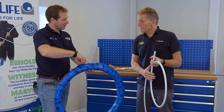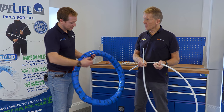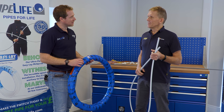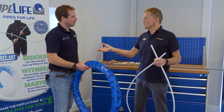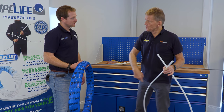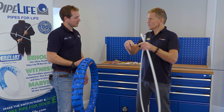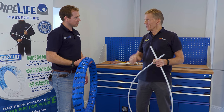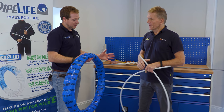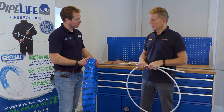Once you cut the outer wrap you can take the spiral off, and then you get down to an inner cellophane wrap. From the cellophane wrap the easiest thing is to just take the pipe from the middle of the coil and pull it out nice and easily, and obviously take it as you need it. With coils up to a hundred metres, without one of those pipe unwinders you can get in a real mess — so always leave the outer cellophane on underneath the blue wrap, which is just to protect it in transport and on site.